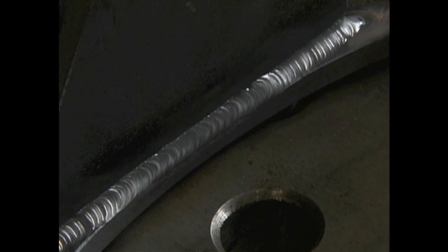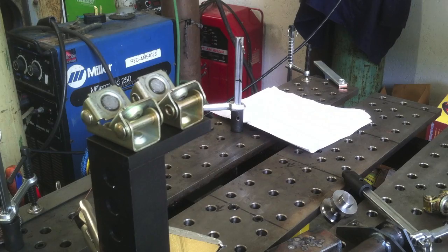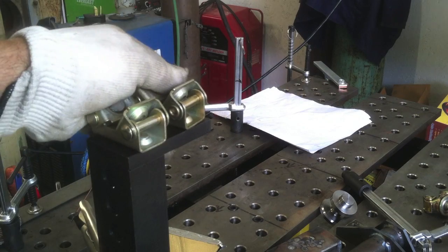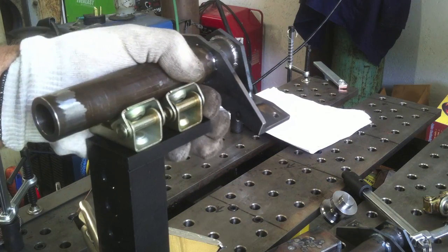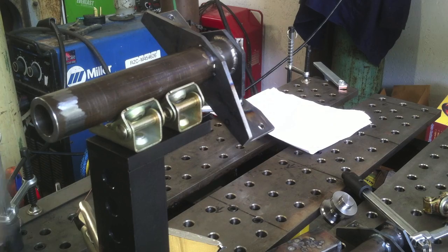I'm pulsing here at around 30 pulses a second — it doesn't look that fast because of the camera, but it wasn't flickering nearly that much under my helmet. I pulse at a minimum of roughly 30 pulses a second, roughly 40 percent background and about 50 percent on-time. Because I'm welding next to an edge and not using a foot pedal, that pulsing keeps the heat from wandering and melting that edge off too much. I'm just using a torch switch and preset amperage, and that worked out pretty well. For the rest of it I wanted to get it up higher, so I put a riser block to get it right in front of me where it's more comfortable. They always said in welding school — the main thing is to get comfortable.